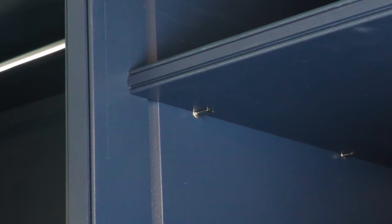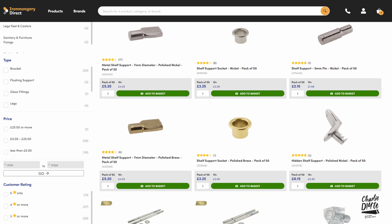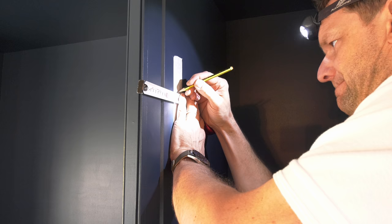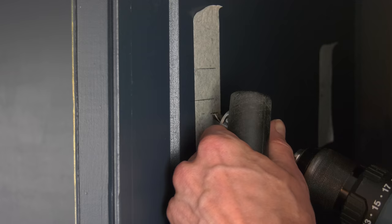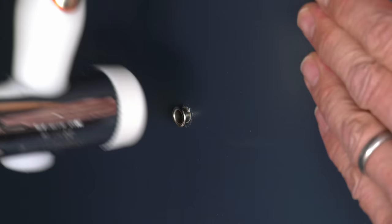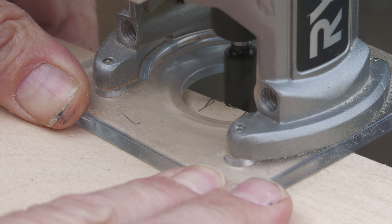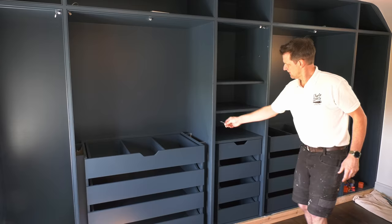Let's have a quick look at the shelf supports in more detail. You do have a couple of options here, from bookcase strips which need to be routed in advance through to the more basic supports that you drill and hammer into the wall of the wardrobe. I decided to go one step better by using these nickel supports with the added strength of the support socket that they slot into. After carefully marking out the position of the supports, it was just a question of drilling a hole - I think with a seven and a half millimeter lip and spur bit - and then tapping the supports into place first with my normal hammer and then with my nylon mallet. With these support sockets you've got a smart-looking, fantastically strong shelf support system. I did need to route a small indent into the underside of the shelf to prevent it clashing with the support socket, but this actually proved a superb way of pinning the shelf into place.